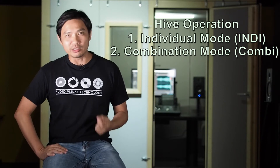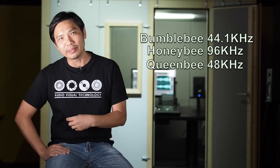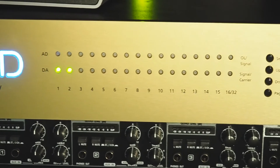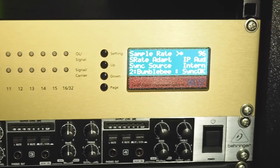In the conventional digital interconnect, we would not be able to achieve this — a Bumble Bee running at 44, a Honey Bee running at 96, and a Queen Bee running at 48. In a conventional digital interconnect this will not work, because you need a single word clock spitting to all the rest of the stations. With Dante, it's a distributed network clock based on the IEEE 1588 PTP — Precision Time Protocol. It states that everybody could be clocked by a single preferred master, and stations or Dante devices of the same sample rate will be able to connect and flow. This would not have been possible in earlier years using a word clock model — this is one of the greatest flexibilities, especially for education where we need good flexibility.